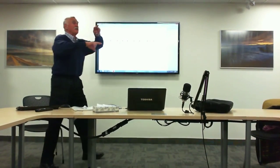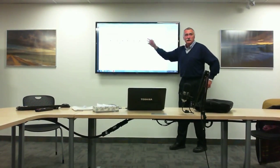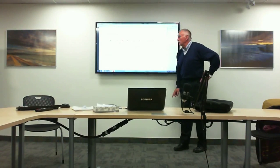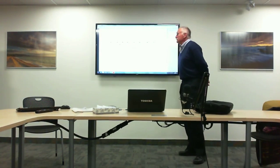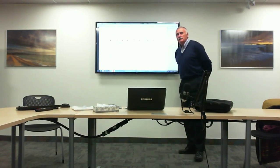So we can well afford to pass the signal through a limiter, which is a positive-negative clipper. So the noise is gotten rid of by the limiter, and then we go into the frequency demodulator. For FM, the inventors of the very first frequency demodulator were Foster and Seeley. And the Foster and Seeley discriminator was improved and turned into the ratio detector.